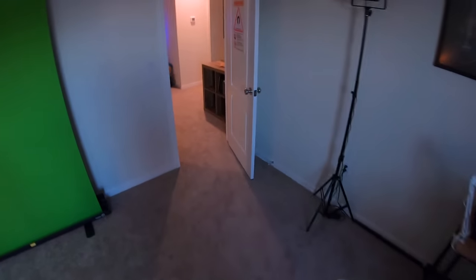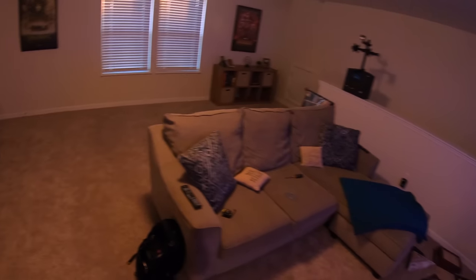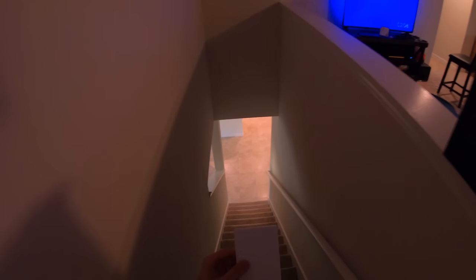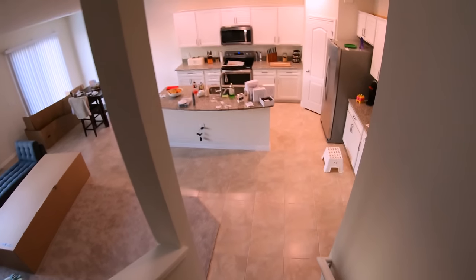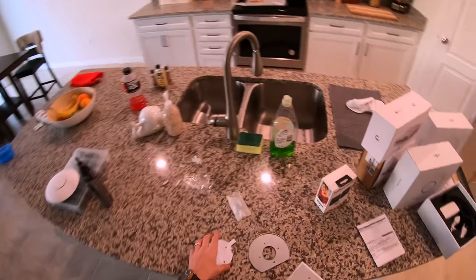Okay, so it's been a minute, and the reason why is because I wanted to figure out exactly how I was gonna do this before I showed you what I did. And this took quite a bit of trial and error, and now I'm confident enough to show you guys what I had to do. Problem is the two Ethernet little port access areas up top on the ceilings, I used standard outlet covers and a standard outlet box, which means the dimensions don't fit the stock little mounting gear included with the Ubiquiti access points. That means we have to kind of jimmy something together.